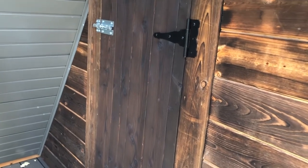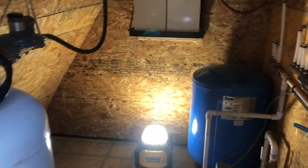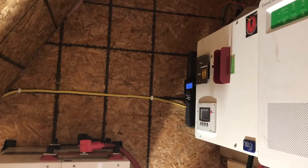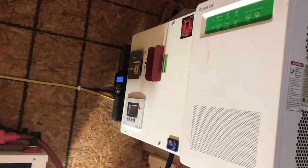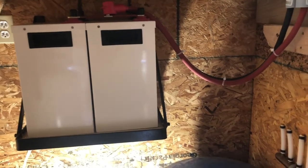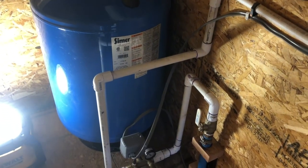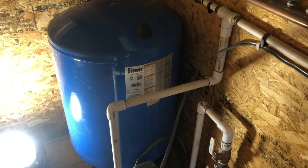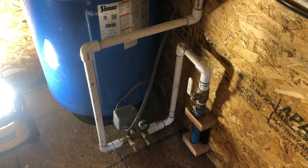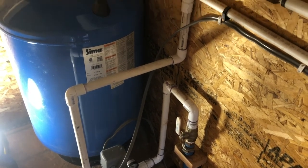This is our utility room. It's not very big, but it's taken a lot of thinking and engineering to get everything in here the way we wanted it — honestly a lot of worrying time to make sure we had things right. This is our well system: 30-gallon pressure tank, traditional pressure switch, one half-horsepower 10-gallon-per-minute pump submerged in the well. Our well is 104 feet deep.